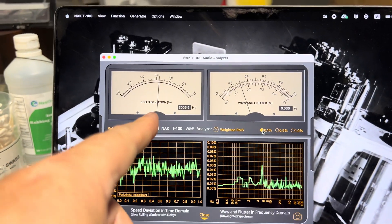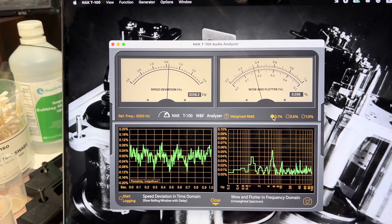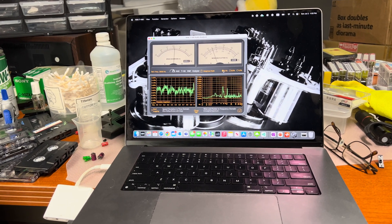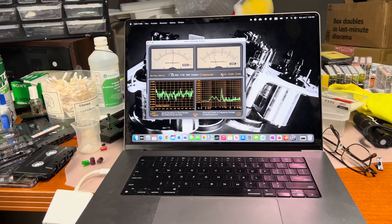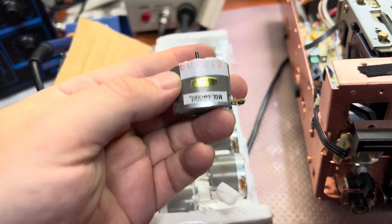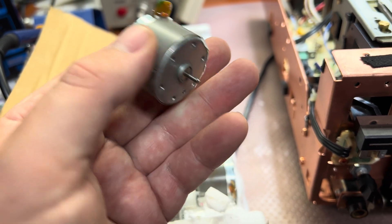The speed — I tried to adjust as close as I could get, and I may adjust a little bit more, but it's not as easy as with RDM motors. So the conclusion: we'll have to do another round with these RDM motors. I'll probably assemble one and see if I can adjust the speed lower, and probably try it on another deck. But for this deck my choice is those Matsushita motors — the ED550L — that I got last time. I very much like them.